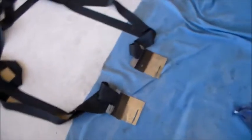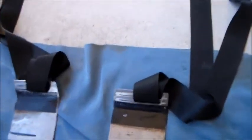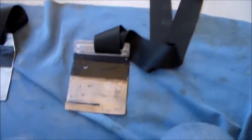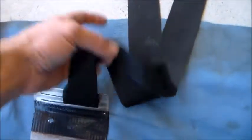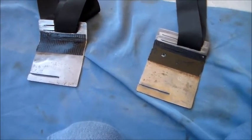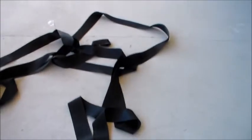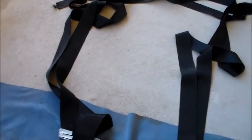These look kind of weird, but what they are is a couple of steel pieces that I made that hold the nylon webbing across the wing. This is two-inch nylon webbing, and I'll thread those steel plates through a small gap at the back of the aileron. I'll show you where that is, and then I'll stretch the webbing around the wing so that when I pull it tight I can lift the wing up and control it with the webbing.